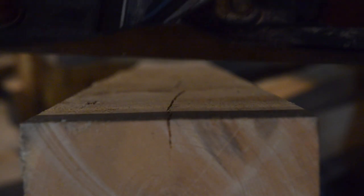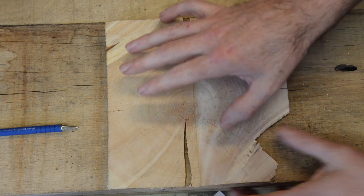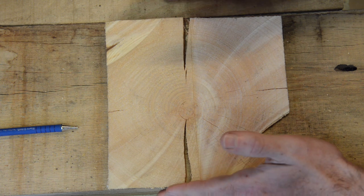You see me here checking the surface with the side of my number six fore plane. This is because in well-seasoned timbers you often end up with a surface irregularity that can really make your life difficult when power planing if not addressed. This cut-off from an eight-by-eight shows how a decently box-heart timber that started off nice and square can develop issues.